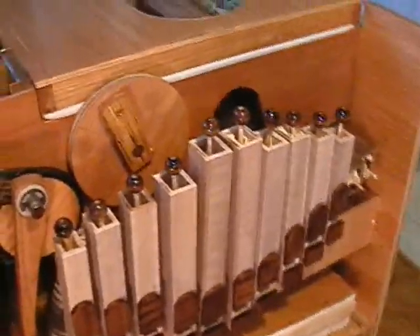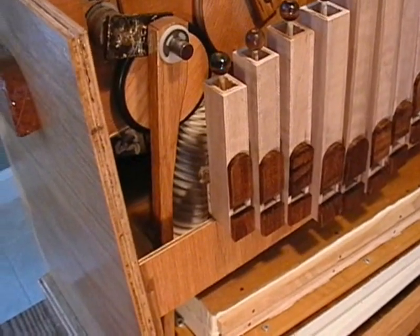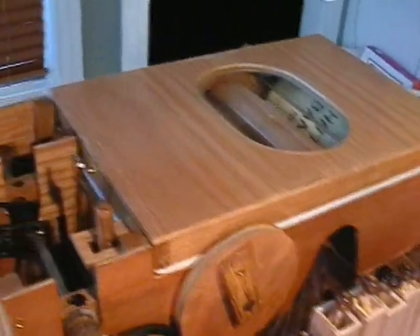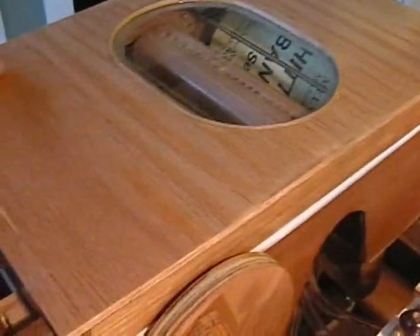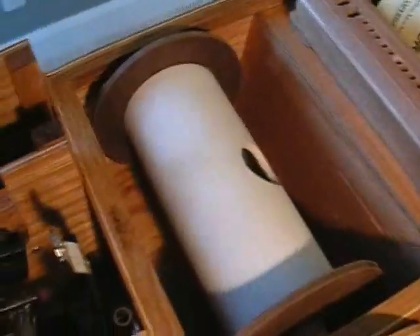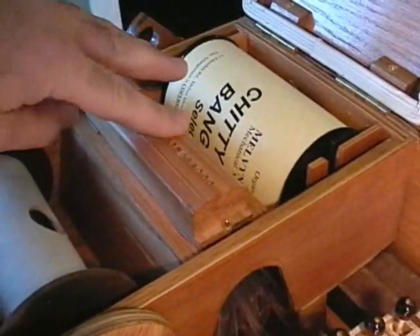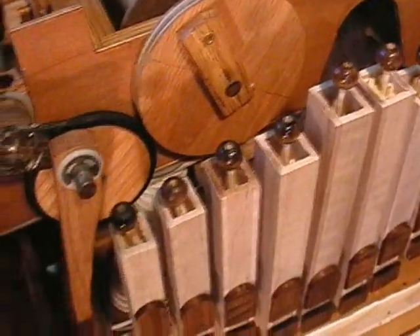This spring puts down a lot of pressure to generate eight inches of water pressure, which then goes up. You can see the vacuum-looking hose that goes up to the box. This top box is actually airtight and the air inside pressurizes, which then, as the music roll passes over each hole, drives air down each hole to the corresponding pipe.